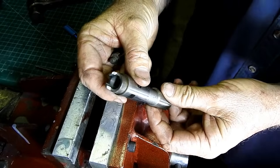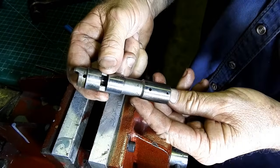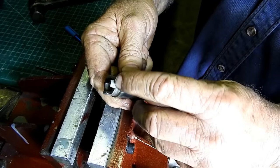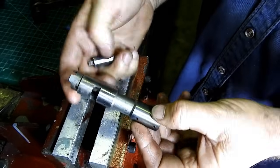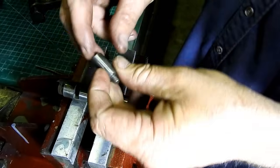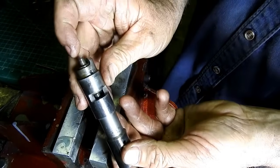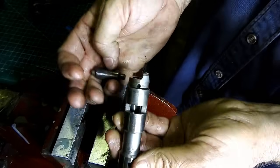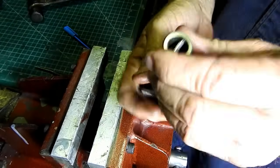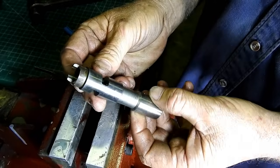The 30-series tractors had a different setup - this valve was actually part of it all coming out together, it wasn't in a separate cartridge as such like this. I have seen many of these with the end broken off where people have been playing with it. What we'll do is go and give this a nice wash, a little bit of 600 to 1200 grit sandpaper, and just make sure it's free. What we're looking for is: when we pop that in there, it drops in and out under its own weight just with a light film of oil. It should just come in and out - I'll go wash this and come back and we'll pop it together.